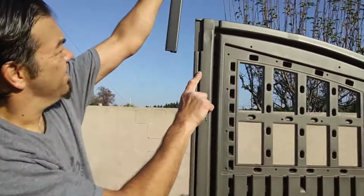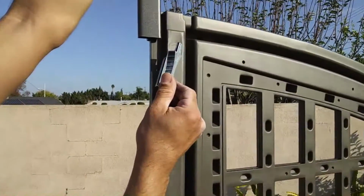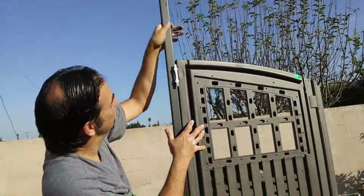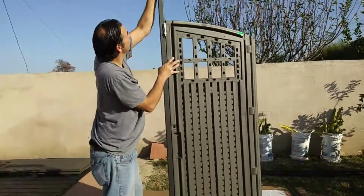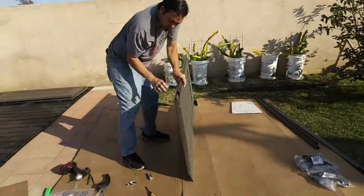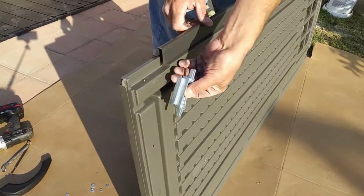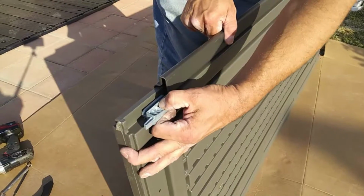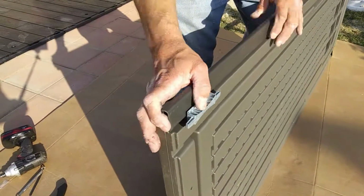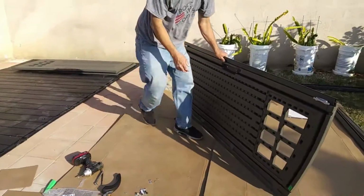I lift that thing up and do this vertically. That helps slide it along. There's a little groove in the deadbolt. You just slide it just like you see there, right through that groove, and it kind of holds that deadbolt block into place. And using the ground to my advantage, that went pretty easily. This is how they show it in the book, doing it sideways. Then they line that little channel up, that little groove with the door. See how the indentation on the door channel is facing forward, because your other door is going to overlap it.